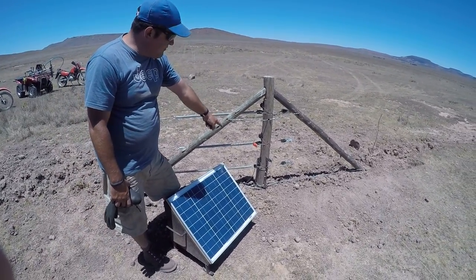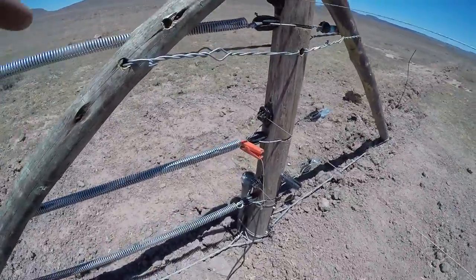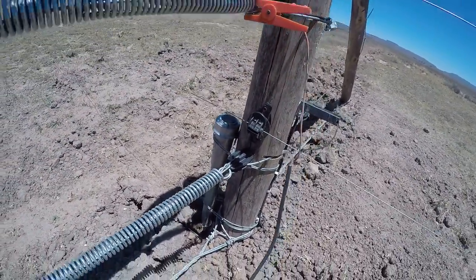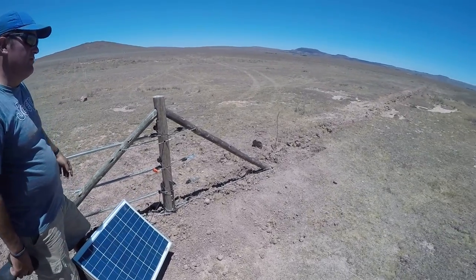The earth wire goes down into the ground onto three stakes, and the beauty is the ground's relatively dry at the moment. There's your pop-up sprinkler - if you want to wet it, put a little stick in there and it'll wet all this ground here and you've got a perfect earth. Put your top sprinklers on the other side, you can wet all this ground here and you've got a perfect edge. There's your springs and there's your 600 metre wire stretching over your main line.